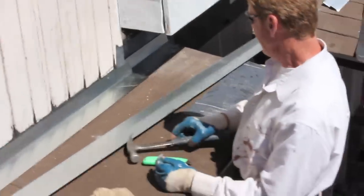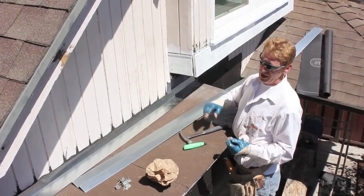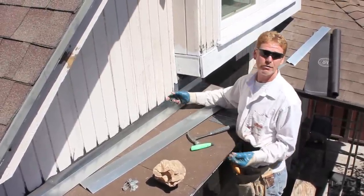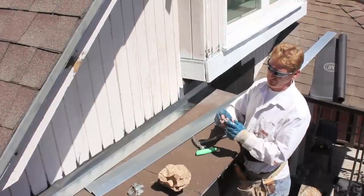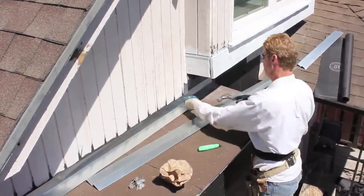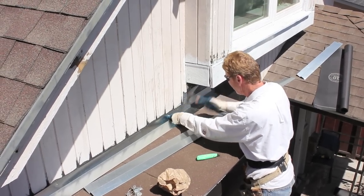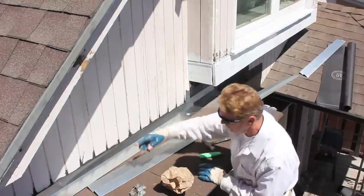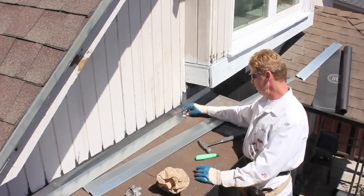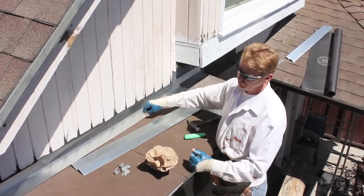And I hate to do this for this fella here. I'm just doing him a favor because he's not sure how to do this. I don't want to just put a regular nail in here, 16 penny or so, because over the years it'll come back up. If it has this little ridge on here, plus it has a wide head, it'll hold this. So we can put a nail in here, like so. Now I'm gonna put a couple more here. Now that roof, this nail right here, the bigger head is designed so it won't rupture through, and more importantly, the shank, so it won't come up.